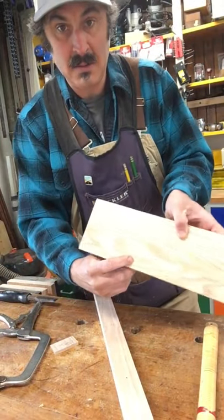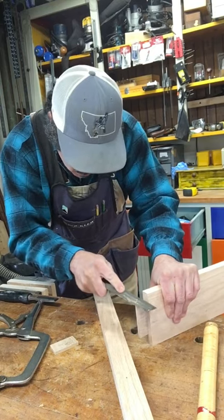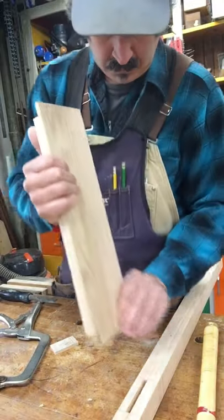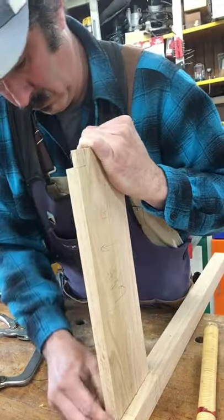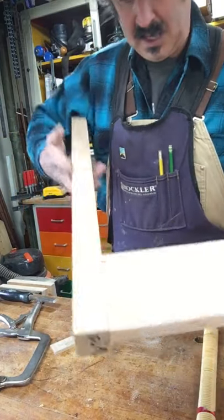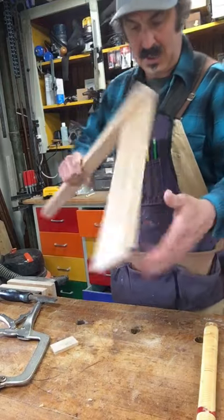I have it labeled with sides up with the arrow. I'll take this off the bottom of the tenon. It's snug — I'll be able to sand that a little bit and get that just how I want it to be. Pretty good. You can see what that fit in the corner there looks like. I don't have a clamp or anything on that — I just pushed it in by hand. You don't want to rely on a clamp to finish that for you. So that seems pretty good. Next one is the other side of the tenon — the other side of the apron.